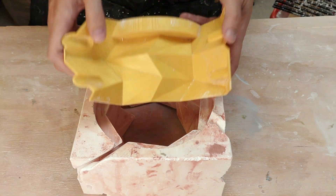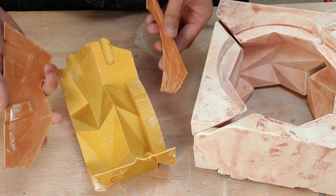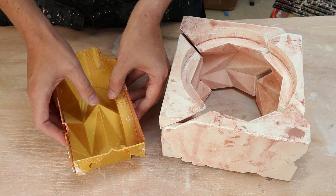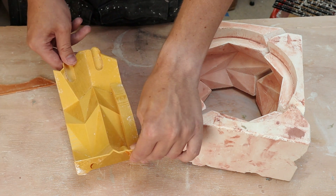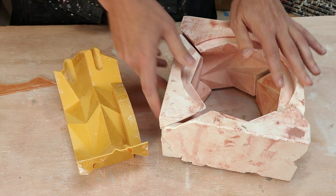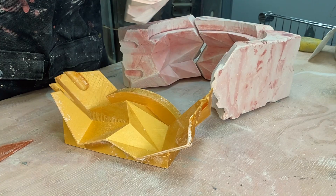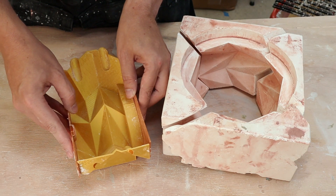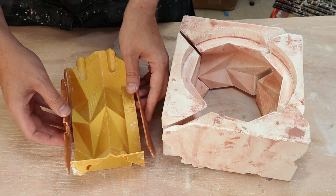So when I made these, I used my 3D printed molds directly. I have a video on this if you're curious, but this is a three-part mold — a bottom and a top. I taped these together, poured plaster in, then removed the tape and flexed the 3D printed mold to remove the piece. I did that four times to get the four sides. When I was making the plaster parts, it was clear that the tops and bottoms were flexing — they're very thin and I didn't adhere them very well, so my top and bottom surface wasn't great.